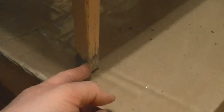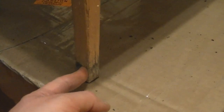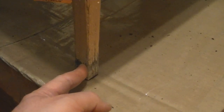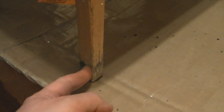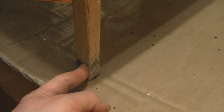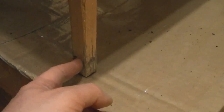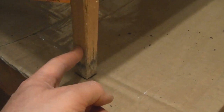What I came up with was, you start out with the bare wood, and you put on kind of like some thinned out whitewash, basically, and then I put amber tinted shellac over that, or you could use amber tinted lacquer. And the combination of the red oak plus the whitish layer gives you kind of a pink, and then you put the yellowish amber over the pink layer, and it ends up actually looking quite a bit like this.